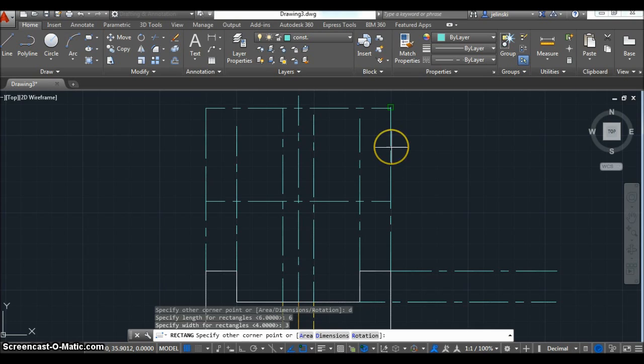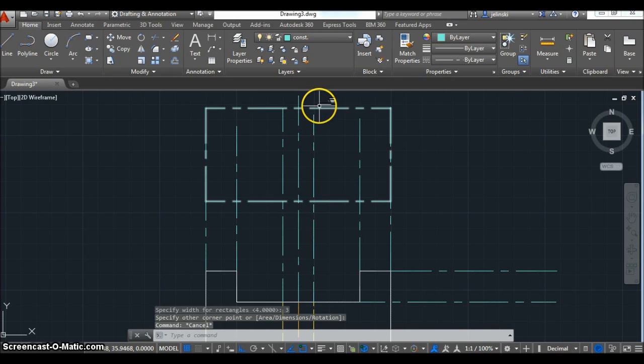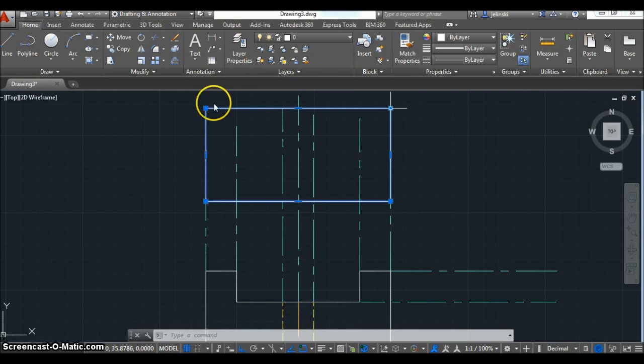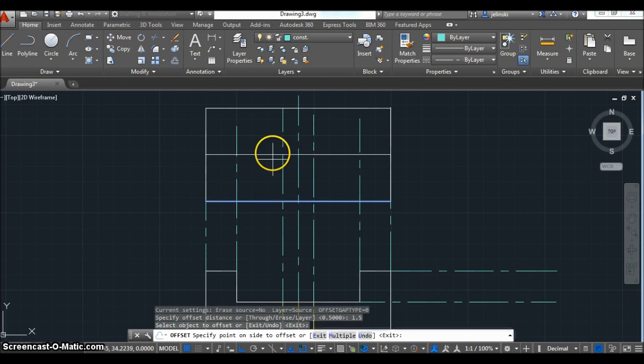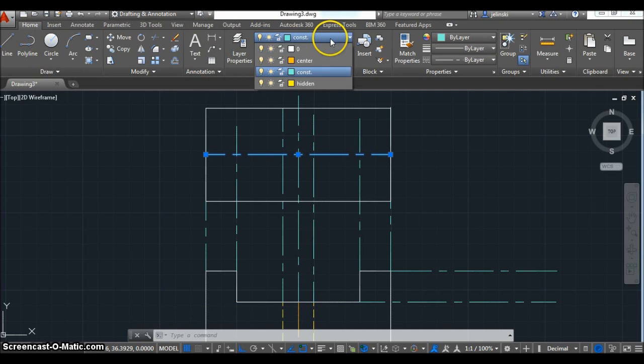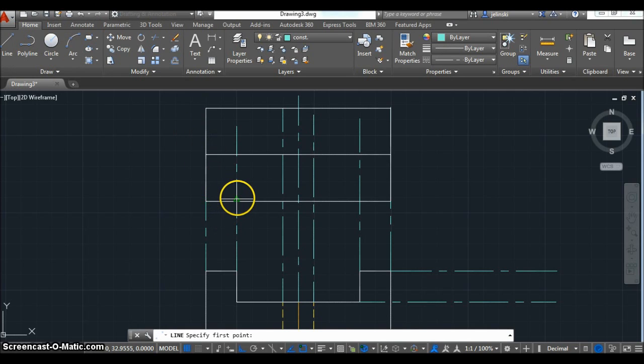The top view has a length of 6, and without that exact length I wouldn't know how to line it up with the front view. Now I have the basic outline of my top view done — that's always the first thing I do. I'm going to explode this again to offset a bit and put that circle perfectly in the middle. I made the top view 3 inches wide, so I'll offset it to 1.5 inches and add a center line. Now I have the center line from my front view and the top view center line to go ahead and make my circle, then turned that into a construction line so I know to delete it eventually.